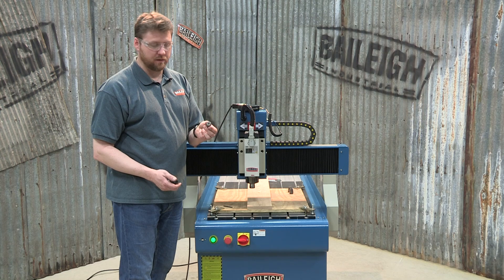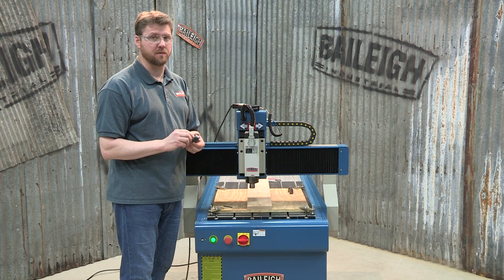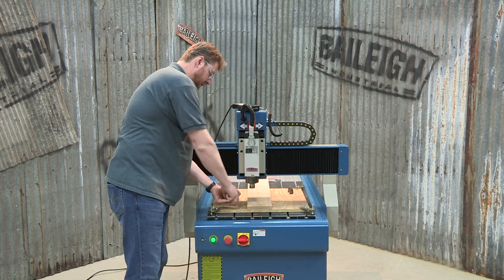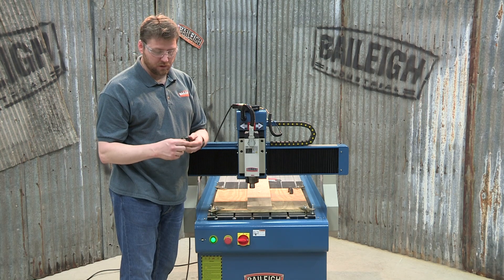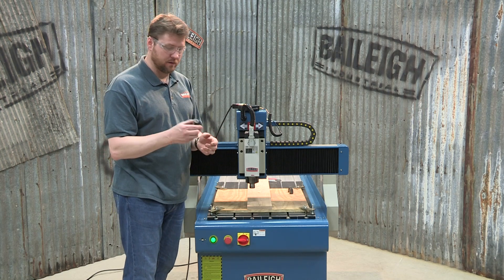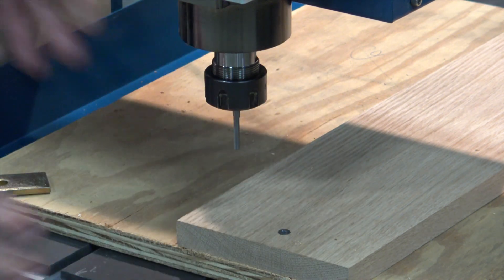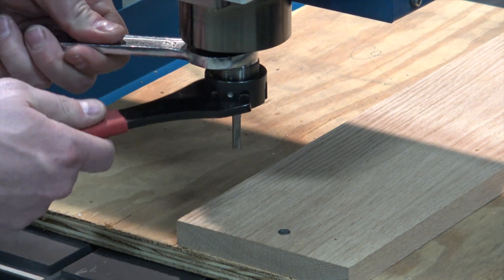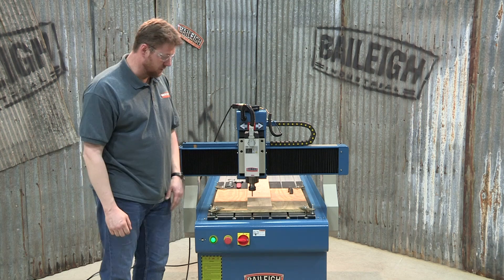This is an ER25 style collet — a very common collet size. I'm going to snap it into the nut first. It's important to do that and not put the tool in the collet first, because then it will not clip into the nut properly. Then take the tool and put it into that collet. Apply a little pressure to make sure it gets down in there. We're trying not to put the cutting surface of the tool itself in the collet because that can damage the collet over time, but we want enough of the shank in so it's held properly — the collet will squeeze down and hold the tool once the nut is tight. Thread the nut on and use the wrenches that come with the machine to put decent torque on the collet. At that point the tool is installed and we're ready to do the tool touch-off.